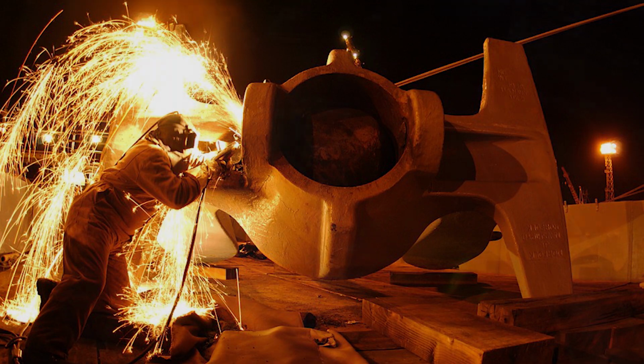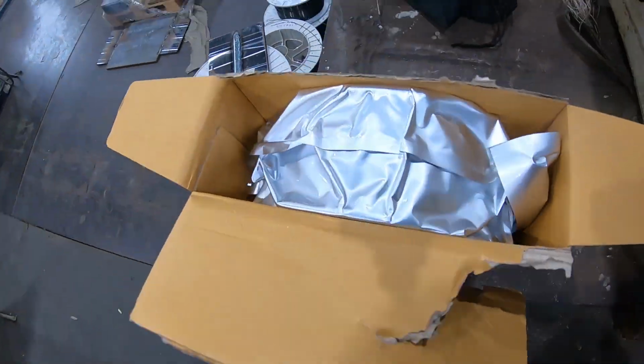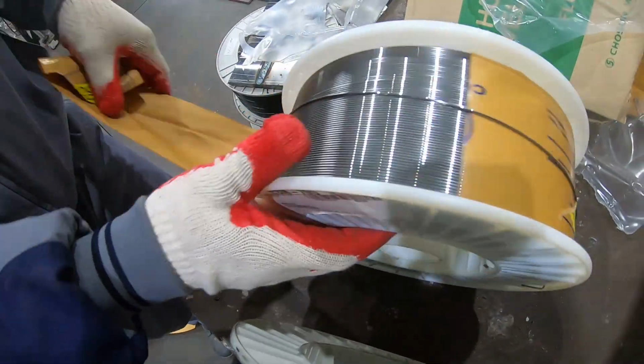Thus, we'll be showing you today about long panel automatic welding, and CSM70U will be used. CSM70U is an exclusive product for 3Y grade fillet. This product's anti-porosity for primer coated steel is outstanding compared to other all-position flux core wires.